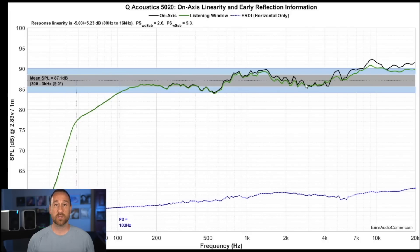In terms of amplifier power or how much power you're going to need, this speaker is somewhere in the mid-sensitivity range. I measured it at about 87 dB based on 2.83 volts input at 1 meter distance — that's an average sensitivity. If you're just looking at the upper frequencies, they could spec it as high as maybe 90 or 92 dB, but on average you're looking at about 87 dB. The F3 is 103 Hz and the F10 is 48 Hz. This shores up my notion that the bass is kind of weak on the speaker — I didn't expect it to be really boisterous, but I wish there was more to it, and I really think that has a lot to do with the upper treble being raised so high.